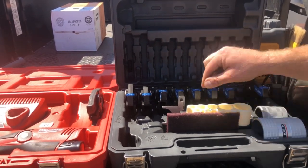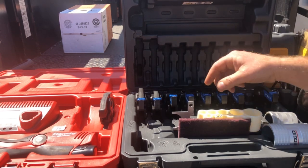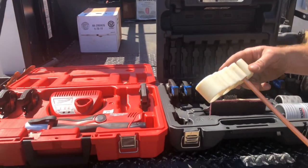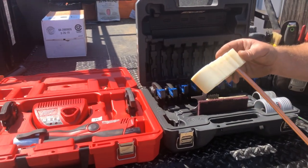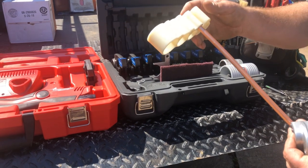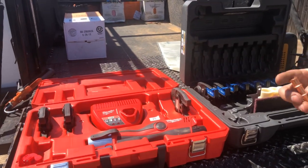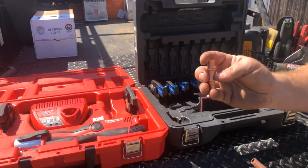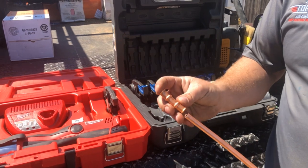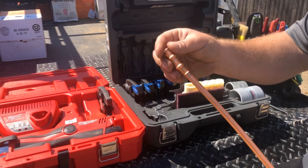You also get a wire brush, a Brillo pad, a crimp gauge for post-crimp inspection, and a depth gauge — which is very important. The depth gauge shows you how far to insert the zoom lock coupling onto each individual size of tubing. We always mark that because the dimple inside the fitting, which is supposed to act as a stop, is not always reliable.